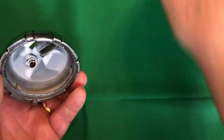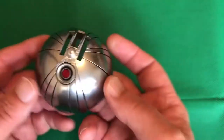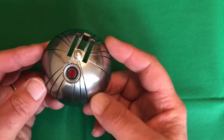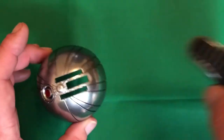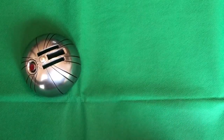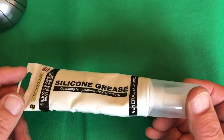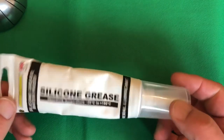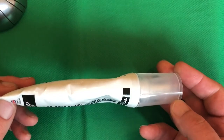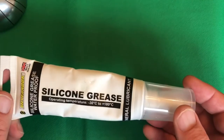Tighten it so it's got a good tight feel to it, and there's your lens cap in place. Before I put the lever switch on, I tend to put some silicone grease on it inside — it just helps when you slide this backwards and forwards. You don't have to, but I tend to do that, so I'm just going to go and put that on.